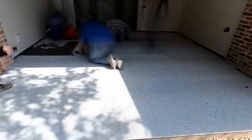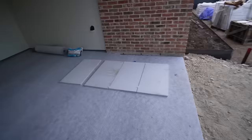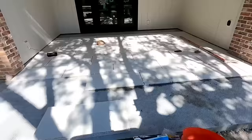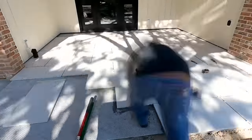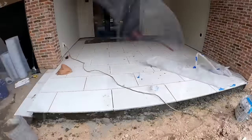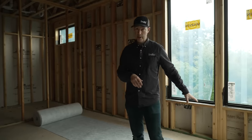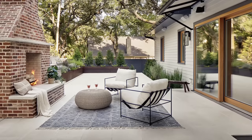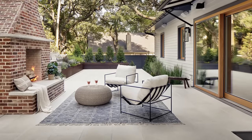I used this on my house on my front and back porch edges, which were slab-on-grade concrete as well, with some concrete collaborative tile pavers. They were basically adhered just like tile — just a little bit thicker, like three-quarter inch thick. My front porch already had some cracks in the slab. Now, here we are a year later and they look amazing. No issues. All those cracks were stopped at that uncoupling membrane.